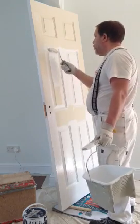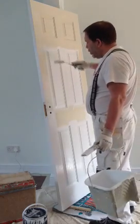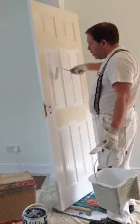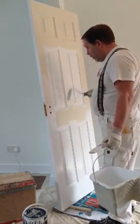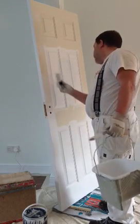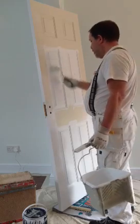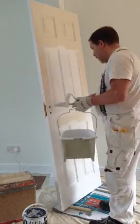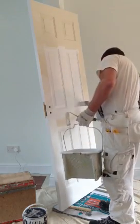Now, what is important is that the sleeve that you choose to use when using the oil-based paints, the satinwood or eggshell, is that you satisfy yourself that you haven't got any of the lint, the fibres still bleeding from the roller. And again, punch in the corners, lay off, lay up.